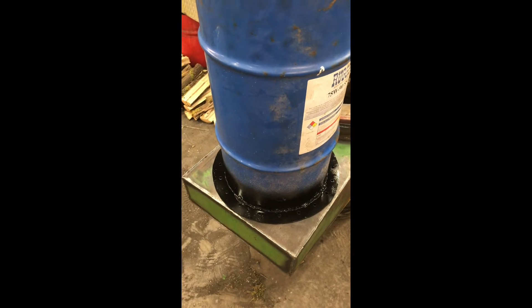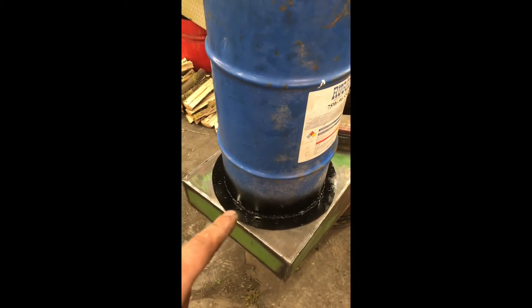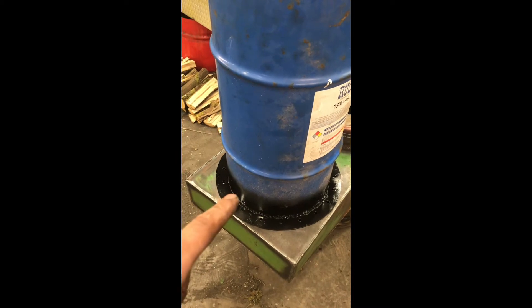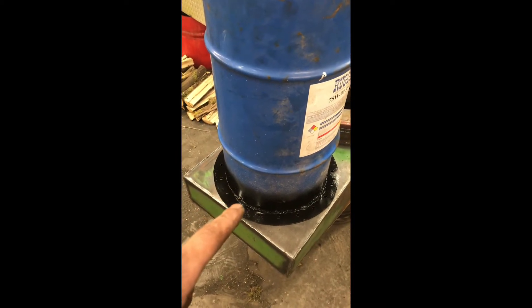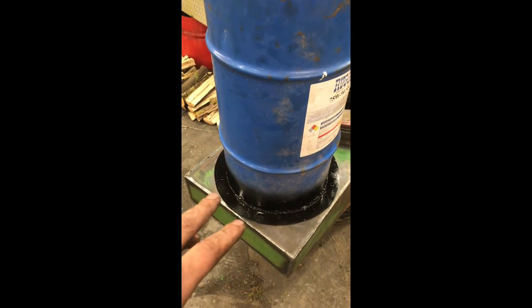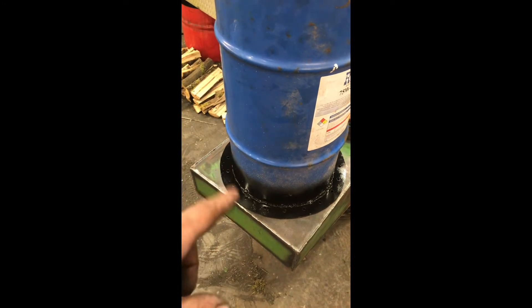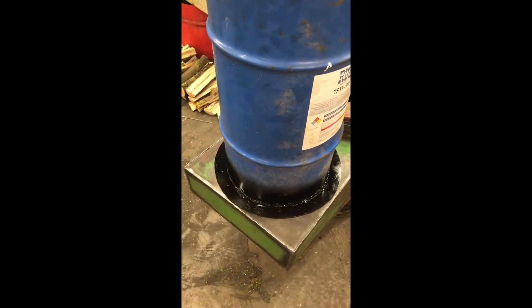That's only a 20-gauge drum — very, very thin material. So once I got the weld all completed, I filled it up with water, water tested it, fixed my couple pinholes, then primered and painted it around that weld, because I need to start doing that on the whole thing. Water testing everything, you're getting surface moisture and getting rust forming all over the place.